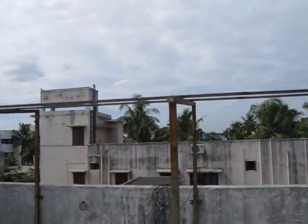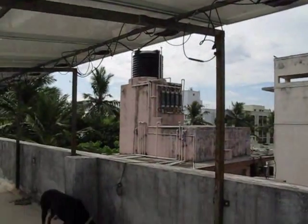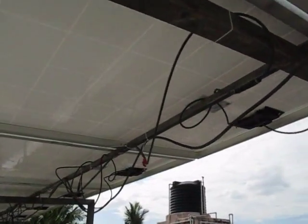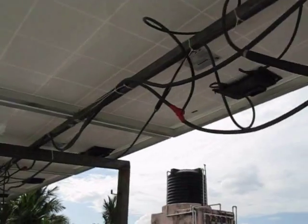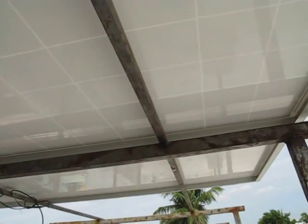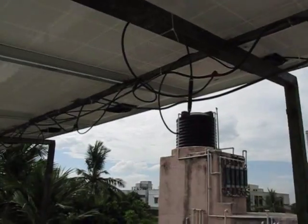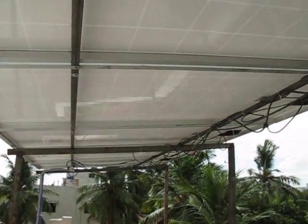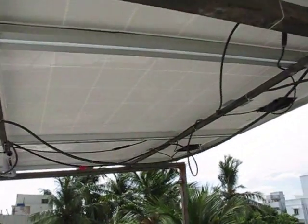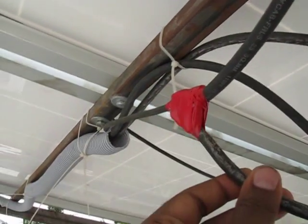I will show you what my problem is. I have several problems. The first one being that I have such a messy and confusing wiring setup. Of these 8 panels, I have connected 2 in series, so I have a total of 4 panels effectively connected in parallel. And I have these types of connections, which is just a disaster waiting to happen.